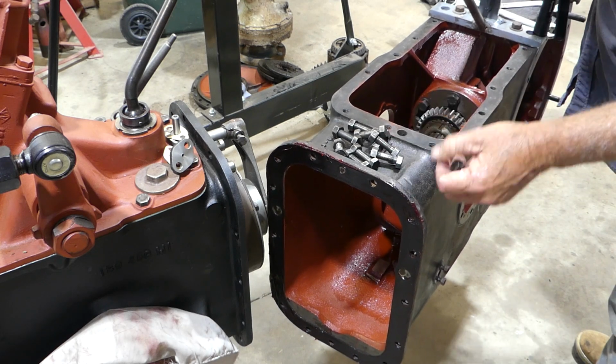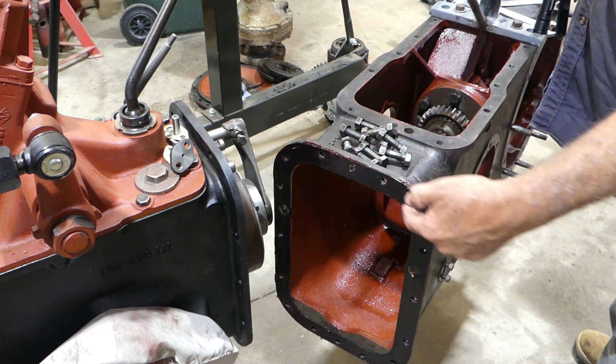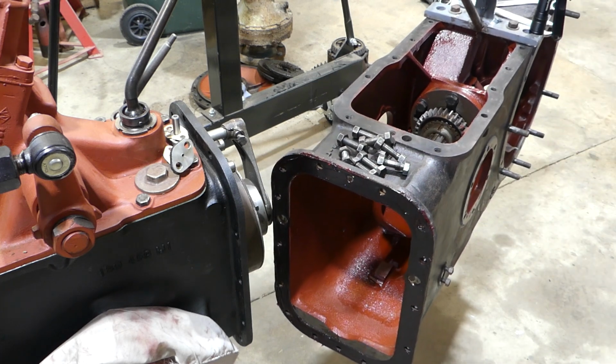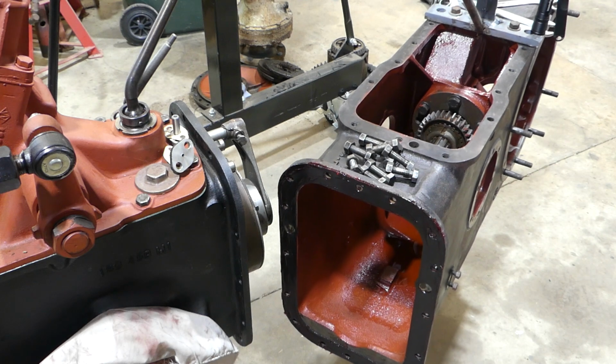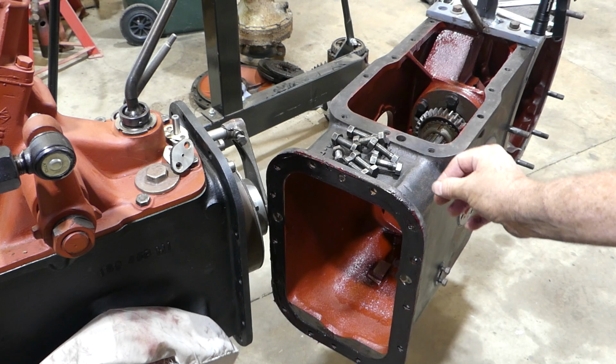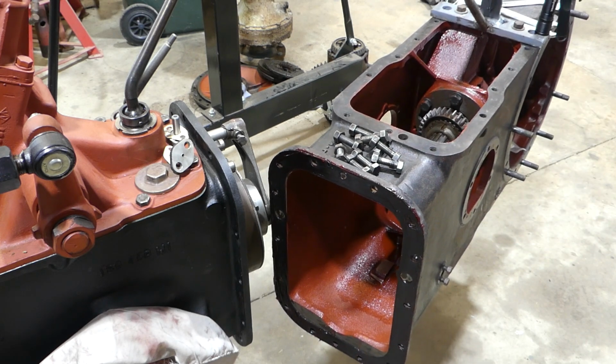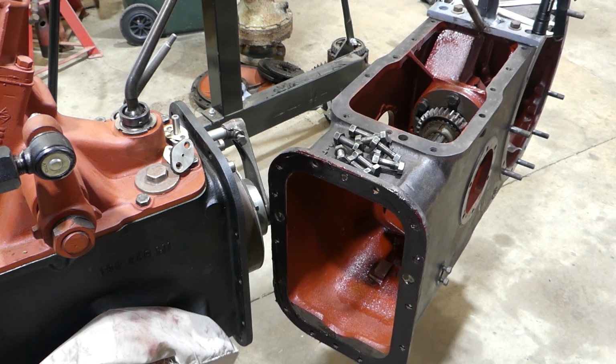Now, I've got the gasket sitting on the back here, and I've got grease on it. The grease, I've just chosen to do grease because when we're painting the tractor, if there's a bit of gasket squashing out here, I can just run around with a blade and wipe the grease off with a bit of petrol or thinners or something like that, and that'll come off.